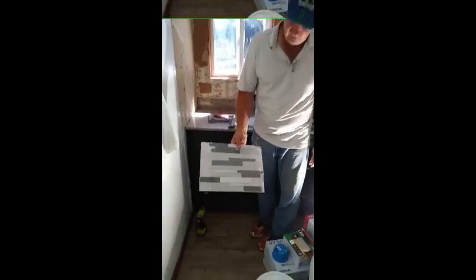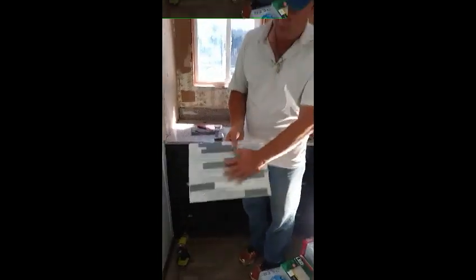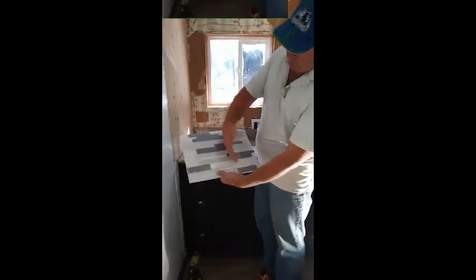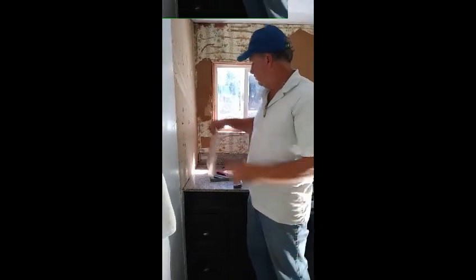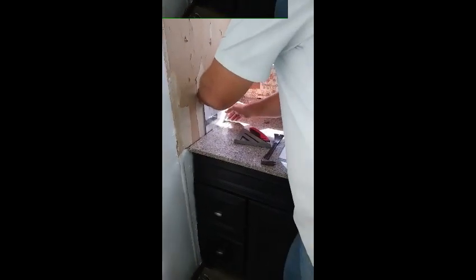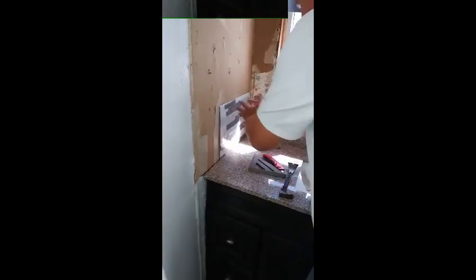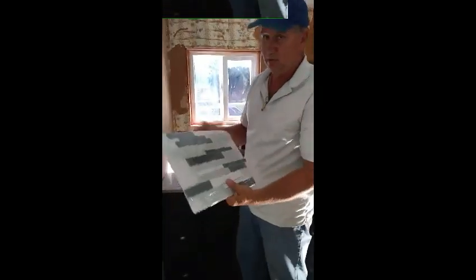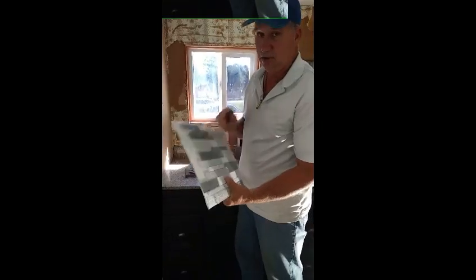What we're doing is working with tile for backsplash. What I like to do generally is cut the tile in the middle or on the side so that I don't have a lot of complications when it comes to going around the corner. In this case, it literally falls out where that row will go over the top. So if I cut this through, I will just leave this section out and then I'll have both sides to start with. We'll do another part where I'll show you literally putting it in. We're going to go outside and cut it.